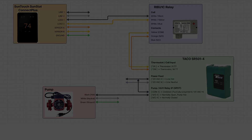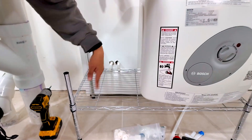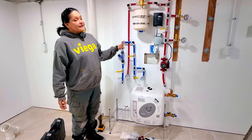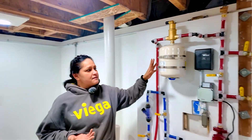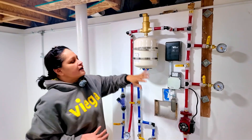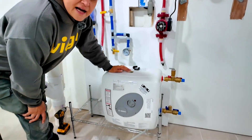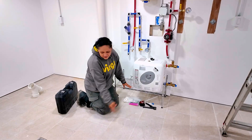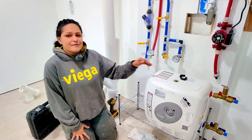We are almost done with all the connections but still have a couple of things to do. First, we need to connect the pipes for the radiant circuit on the floor — they are going to come here and here — then plug in the water heater. The final step is the relief valve, which is pretty important. We have our expansion tank as the main protection against pressure changes — think of it like a balloon: if there's any pressure problem it compresses the air at the bottom, because you can compress air but not water. If the expansion tank fails we have two more points: a relief valve up here and a relief valve on the water heater. We'll connect them into a single circuit going into a container down here. We could have run a line to the floor drain, but it's a closed system loop so we don't expect many issues. Let's get this going and start testing the system.